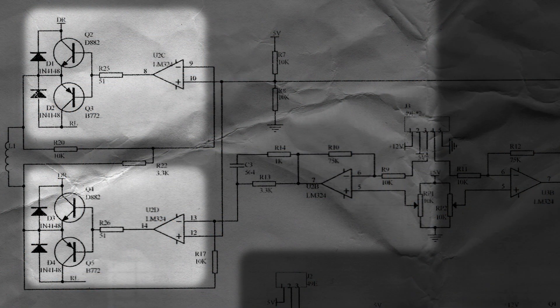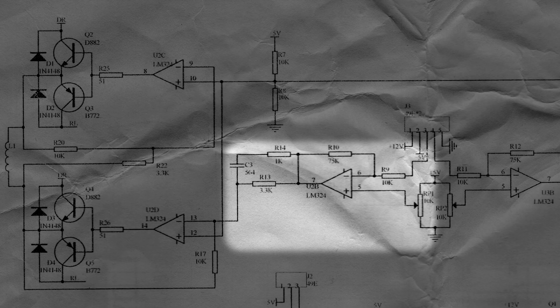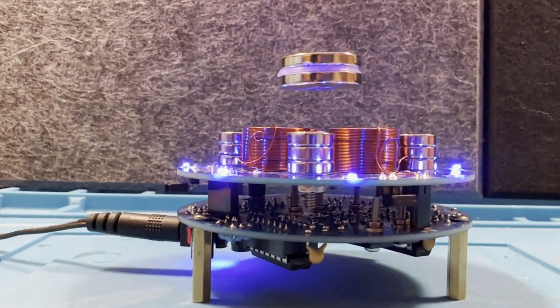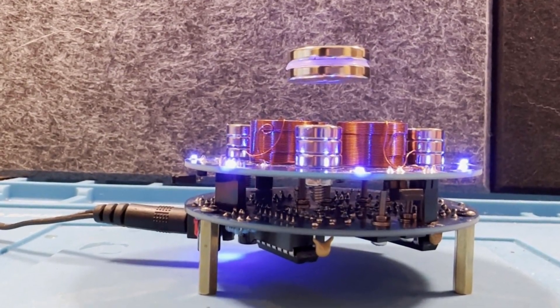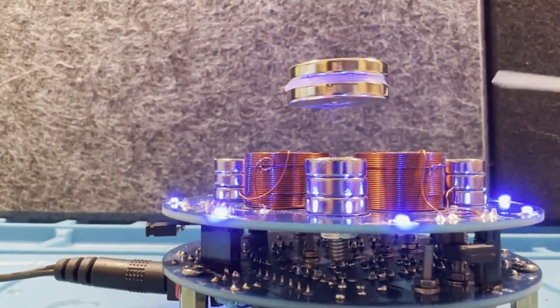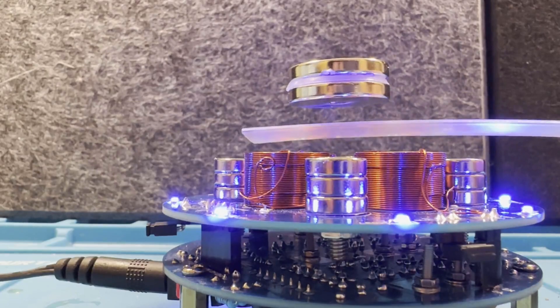Given now we know how those sensors work, it's actually really simple to build an amplifier around this. You can see a variable resistor here, which is used to set the centre point. Given that when there's no magnetic field, or if it's directly above, the voltage will be half the supply rail, the signal is fed into an op-amp used as a comparator — i.e., it will amplify the difference between the two inputs. And I think the capacitor on the output is probably to dampen and filter the output a little to prevent it from moving too fast. I've tried to capture this as best as I can, but the magnet truly is floating. I can even do the magician's trick and wave something in between — not all tricks are done with mirrors!